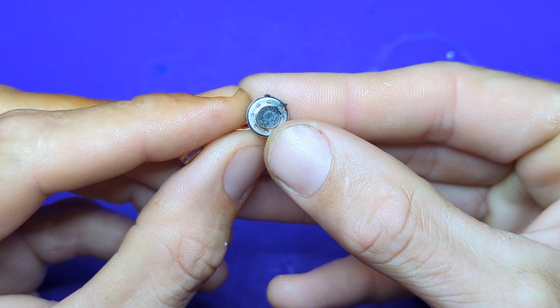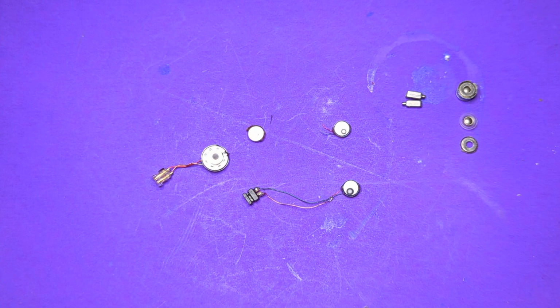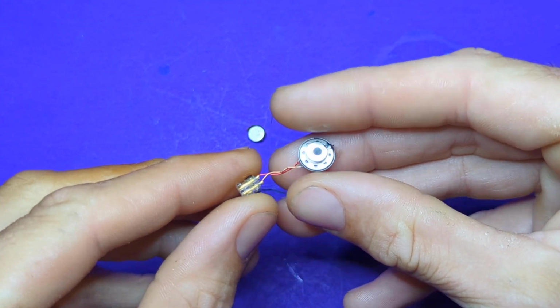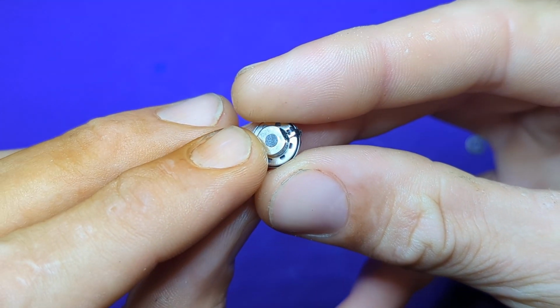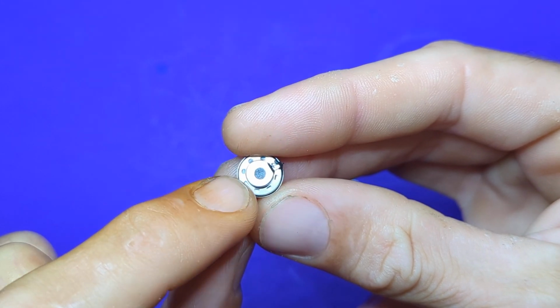Now this uses strictly a PET membrane for the diaphragm. It does not use any kind of metallized coating or any special coatings, nothing like that. Sorry, I need to turn this off real quick. So anyway, it's just a typical diaphragm, except it's completely flat and has a voice coil directly attached. And then also there's some dampening. So you see they have some dampening on the front there. That middle hole, that's where the treble comes out of. And then the surrounding holes, that's where the mids and the bass come from.